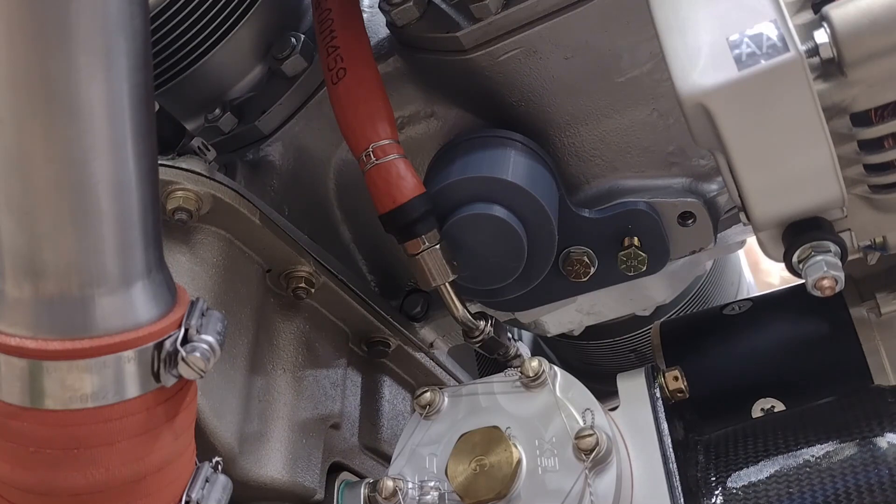The main issue obviously is not during flight itself, but with a hot start after the engine's only been sitting for a little bit — then trying to get the thing started and dealing with vapor lock. The reason I'm going with the fuel flow divider on the top of the engine is really twofold. One is that it's already up there and mounted, and I don't want to mess around with trying to bring it down below. That said, I will if need be, or if I find an issue with a hot start — there's data for both sides.